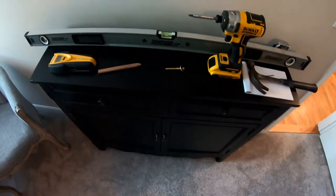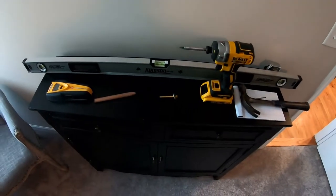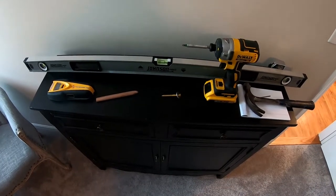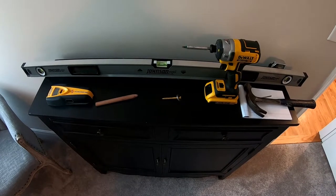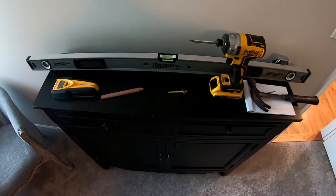I made sure to center this cabinet perfectly on a wooden stud. If you don't have a wooden stud, the only way I'd recommend hanging this is with heavy-duty fastening devices for sheetrock called a toggler — they have a quarter-inch bolt size rated up to around 265 pounds. I'll put a link for the toggler on Amazon too.